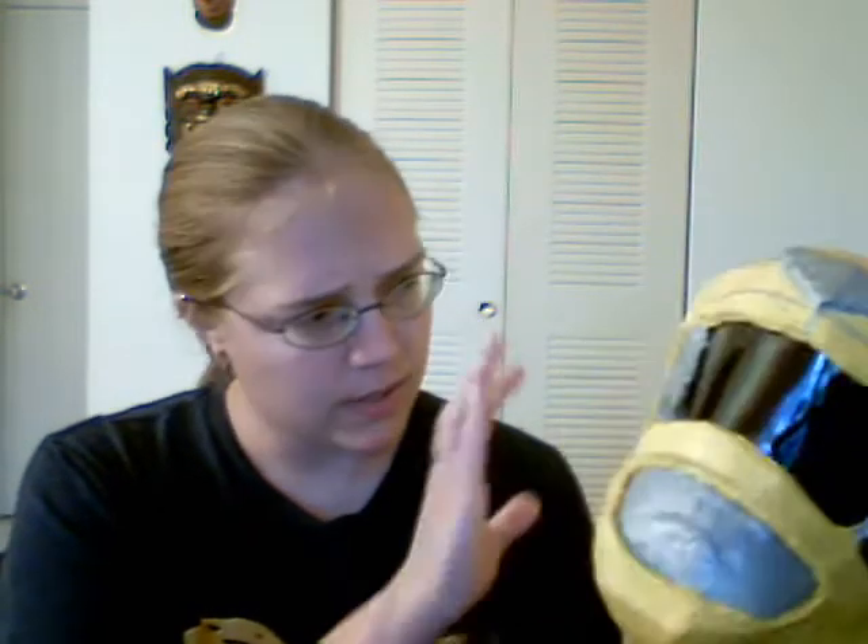The thinnest one I could find was .093 inches. What you want to do is put that in the oven for about five minutes at 250 degrees. When you take it out, it's going to be kind of floppy — you'll know right away. I went ahead and pushed it right up against the place I wanted it to be. There weren't any ill effects, so I molded it to the shape. I did have to do a lot of cutting with the Dremel. This piece is separate from the two on the sides, though I think I could have done it with one piece.